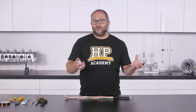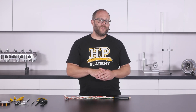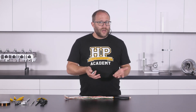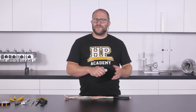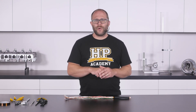Our harness sections between branch points will not change in construction along their length. The number of wires will remain the same and all those wires will remain in their layers. The same cannot be said for branch points, however. Our branch points are going to be thoroughly strain relieved and typically booted in a rigid moldable shrinkable boot. We take advantage of the strain relief at these points and use them to make the necessary changes to our harness construction.